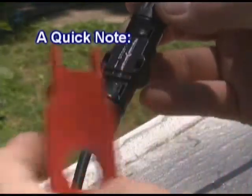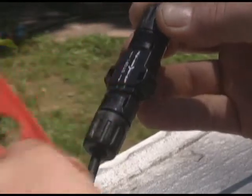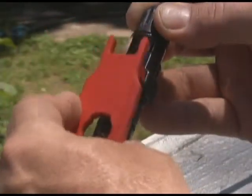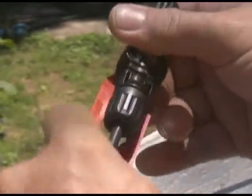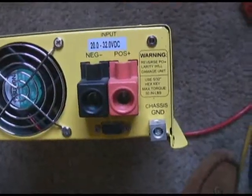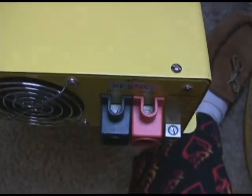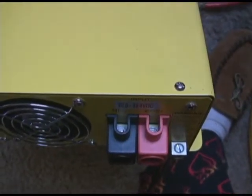Here's the MC tool. You're going to need one of these to actually take connectors off. You actually insert it right into the side of the connector, and then that will allow you to release the connectors. One of the types you're going to see is where you push the wire into the hole, and then it has a screw head on the top or the side where you put the screwdriver in.